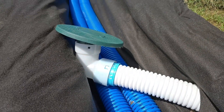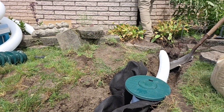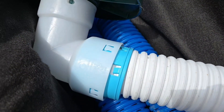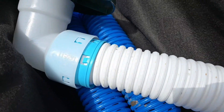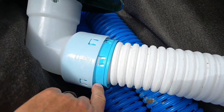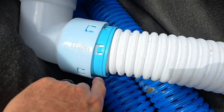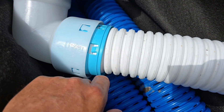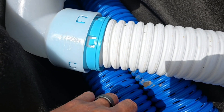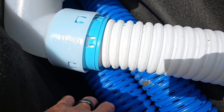This is something that people struggle with. We caught all the contamination with the leaf filter and the catch basin. We do not have a bottomless sanitary tee in our French drain — we don't want to do that. We want to put this not-quite-a-90 in here. Water is just going to leak right out of the fitting right here. This won't freeze in the winter that way. It's always going to be empty.